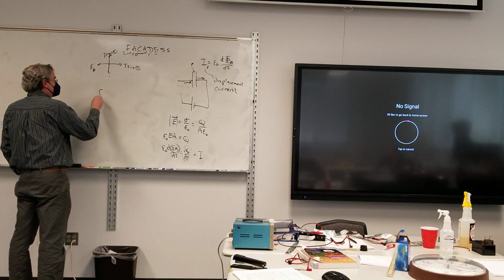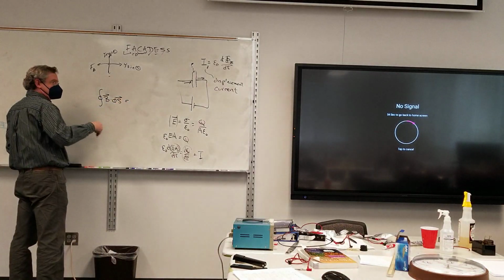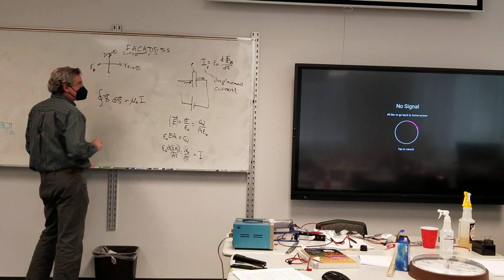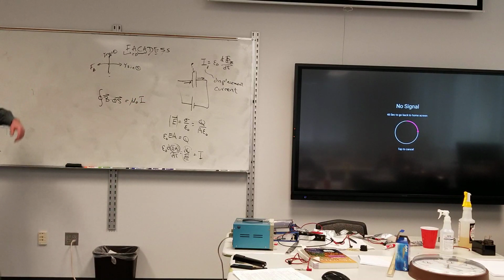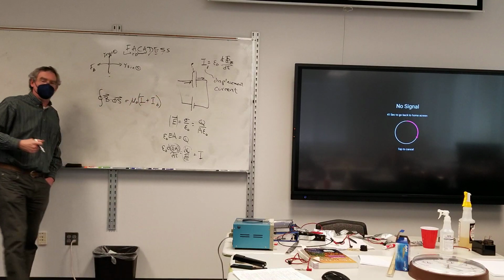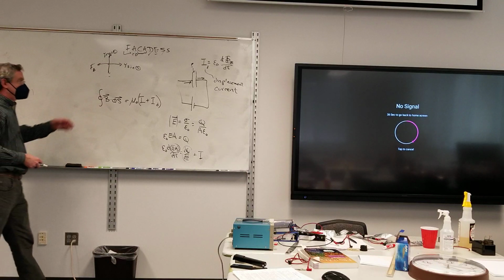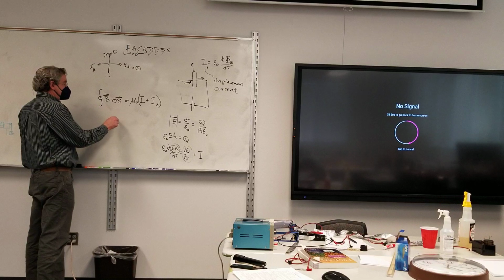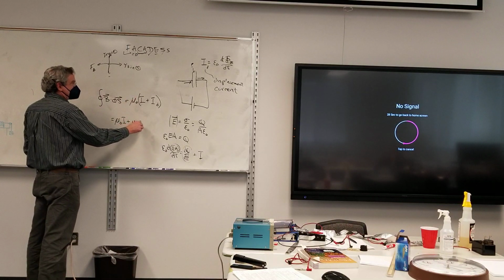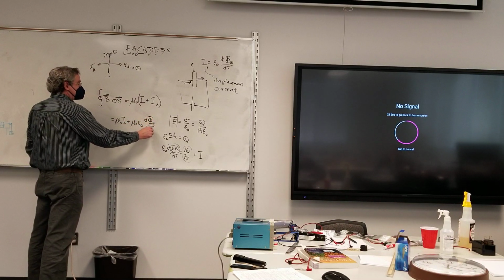Ampere's law is that if I do a line integral of the magnetic field around some closed loop, I get mu naught times I. But there seems to be a second kind of current here, so if we stick in the second kind of current, the current based upon charge flow and then the current based upon the change in the electric flux, the formula becomes mu naught I plus mu naught times epsilon sub naught times the time derivative of the electric flux with respect to time.